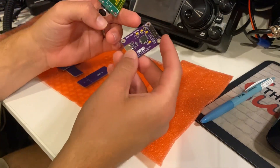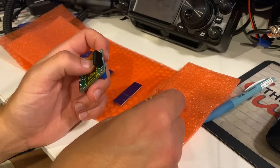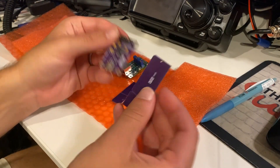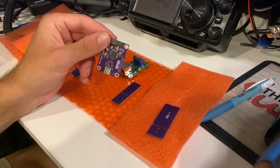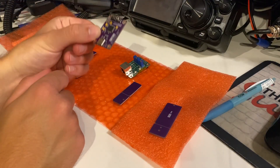Through the magic of editing, it's a few days later and I'm in a different t-shirt, so continuity is completely gone for this video — but there's a good reason. First off, I have installed the headers: the male header on the main interface board and the female header on the daughter board. I've also snapped off all of the extra bits of PCB material. That was really easy — I just used a Stanley knife, etched along the grooves until it was just a little bit flexible, then easily snapped it off.